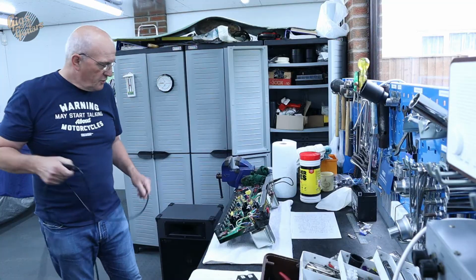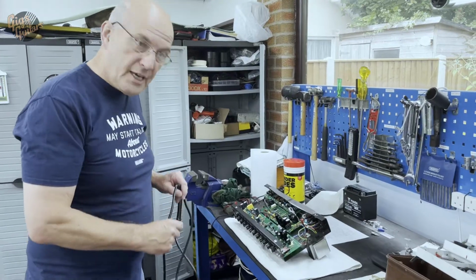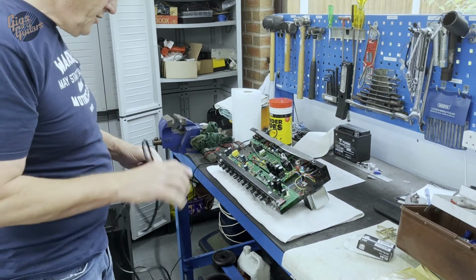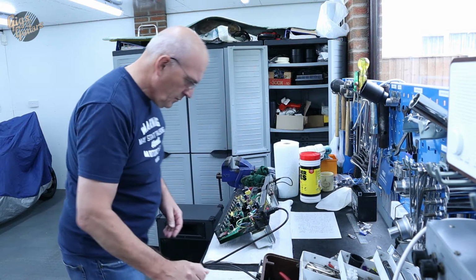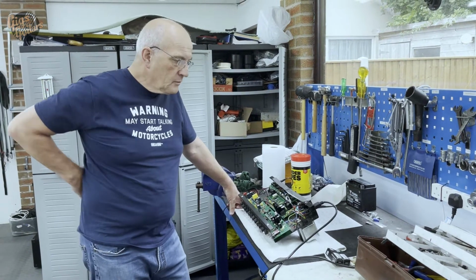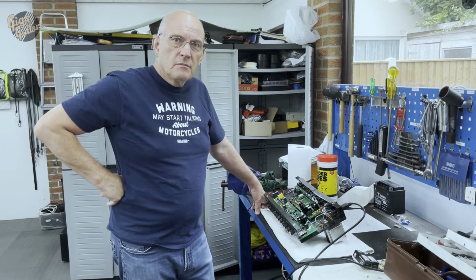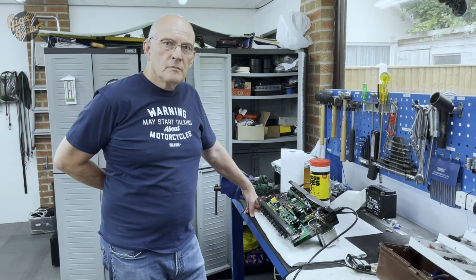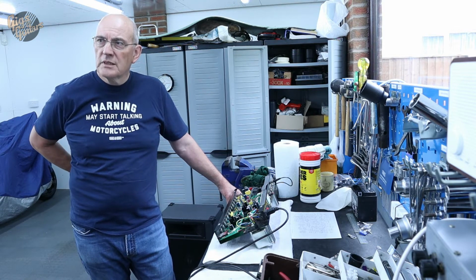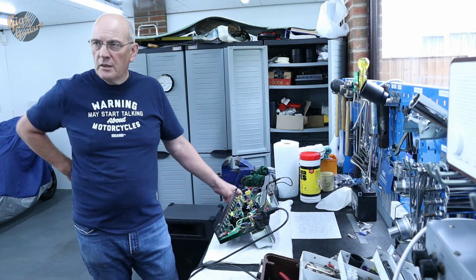Right. We've just reconnected that up to the A20 load. Yeah. A20 speaker, and we'll give it some mains. So, just to recap, we identified that it wasn't a matched pair of valves. One of the valves was blown, and how we sort of finished it off was ordering a matched pair, which is what we've got. But we also mentioned there's a bit of a crackle going on in the background of the amp as well, which is something we might need to look at, I think. But yeah. Am I right in thinking we're just going to basically see what happens now with the new valves and then take it from there?